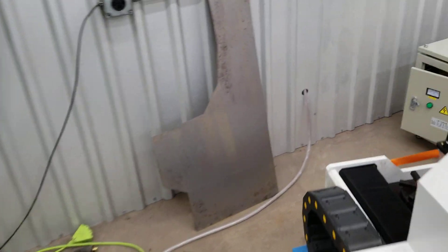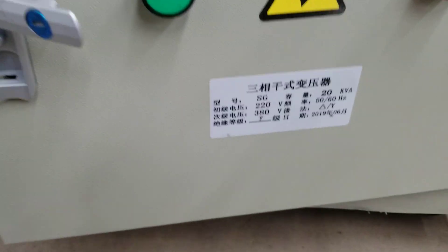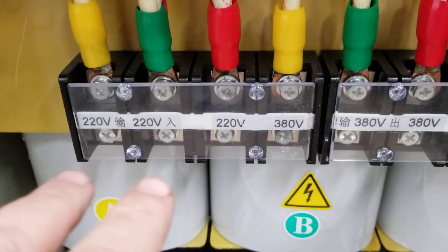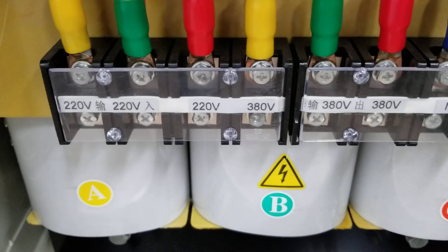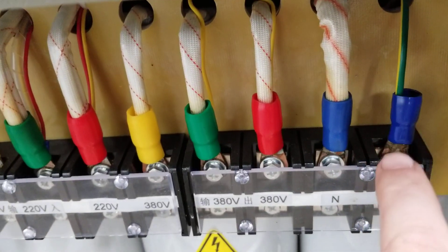One of the things I'm trying to connect is this machine has three-phase 380-volt servos. They included a transformer that takes three-phase 240 into three-phase 380, and this is the hookup for it right here. My three-phase wires will go on the input coming from my breaker, and then these three-phase wires here that are 380 are the output. You can see they've got knockouts to come into the box and knockouts to go out.